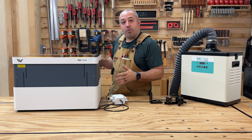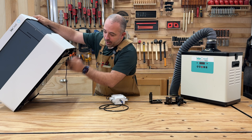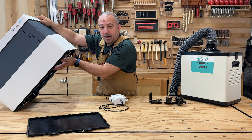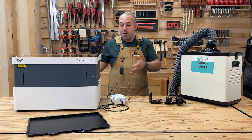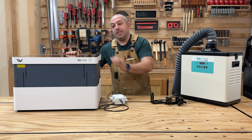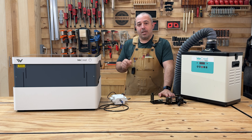Lastly, we have no pass-through option on this. So if you need to engrave something very long, there's currently no option for a conveyor system. If I tip this up, there is a tray that comes out exposing the laser, so if you did have a very tall product, you probably can put this up on some support blocks of your own making and the actual engraving bed is open at that point. So you do have the possibility of engraving on much taller stuff over what this machine can already do, which is a pretty impressive height. That was my thought on the WeCreat Vision. I really applaud this company for coming up with a new form factor, for keeping it fully enclosed and safe, and I definitely like the camera — although you do have to be conscious about those corners where you're going to see some positioning errors.